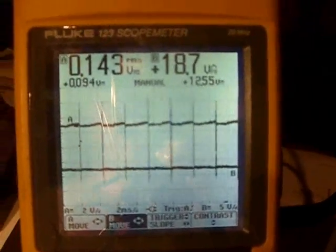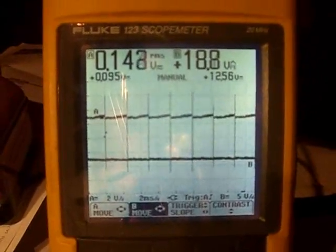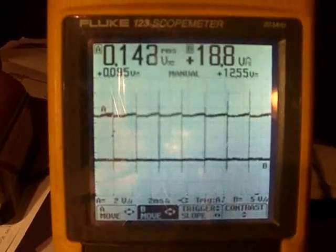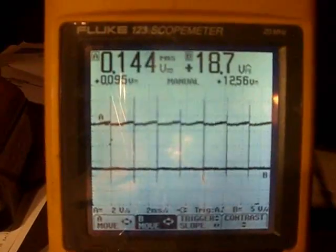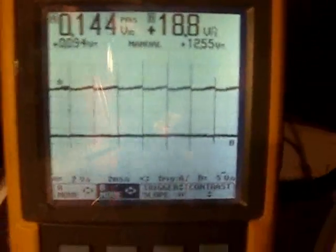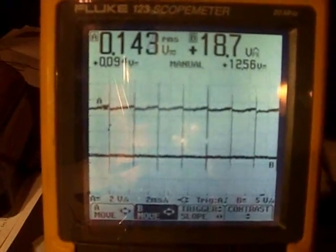It was 12.55, and it's slowly moving up to 12.56, so I'm just going to check in a little bit and see if it gets up to 12.57. Definitely getting a kickback to the front battery just by using the MOSFET. On the left side you can see the RMS is over a 0.25 ohm shunt — I was just doing that to measure the current draw. Again, not trying to check efficiency, just testing the circuit.